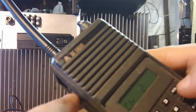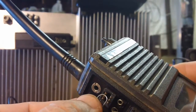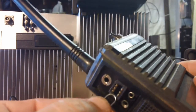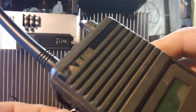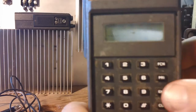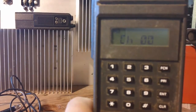As you short those two pins together, press Function at the same time and that puts the radio into programming mode. Just those two bottom pins — because if you short out pins one and six up top, you're going to blow a fuse inside the radio and it's a pain to replace. So here we go: the two bottom pins, paper clip, Function at the same time. It comes up with 'ID' — that's the password prompt. All passwords on these radios default to zeros, so enter six zeros, then Enter, and you're in.